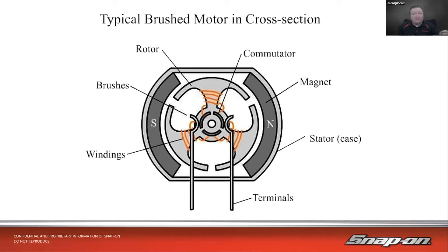On this motor we have three coil sets — the coils are wrapped around the rotor, which is the part that spins. On the outside we have the stator — the part that stays stationary. Easy to remember: rotor rotates, stator stays still. We have a north and south on our permanent magnets in the case. When we apply electricity to these coils, it generates a magnetic field, and the rotor spins by repelling off the magnets depending on the direction.